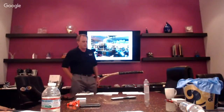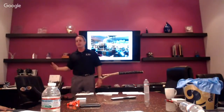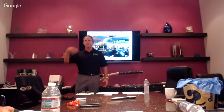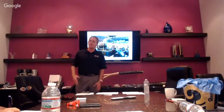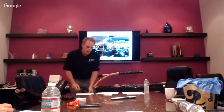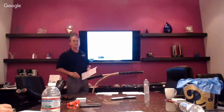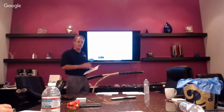Okay, so the bundles can go underground or overhead, and we need to know that. And it changes sometimes. It's really weird. It's designed one way. How it ends up being another way on a job site after it's all done is beyond me. But that's our world. And if we didn't have those changes, they could have robots doing our job. Please get a robot. So it's either underground or overhead. If it's underground, we need to make sure that it was put in to specification. Voila. 24-inch radius. We'll go over that in a minute.